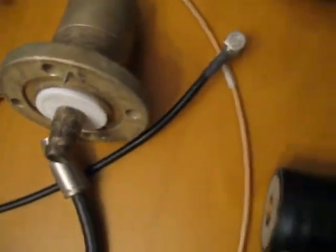Now this is a higher power 15 kilowatt capability, 1 5/8" cable, also 50 ohms. This is Cellflex. And so you'll see when we look in the end that it's filled with a closed foam. No pressurization is necessary because there's no way moisture can get in between the center conductor and the outer conductor. So that's a 1 5/8" 50 ohm Cellflex, and there's the flange that would be typically used for that.